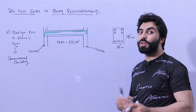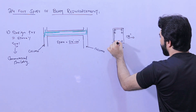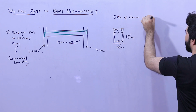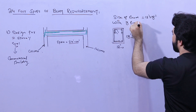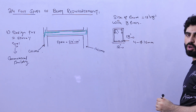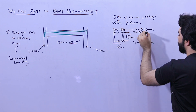With the factor of safety applied for G plus one, this design can actually be used up to G plus three. The beam size is 12 inches by 18 inches with eight bars total. That is four bars at the bottom with a diameter of 16 millimeters, two bars at the top with a diameter of 16 millimeters, and two sidebars also with a diameter of 16 millimeters.